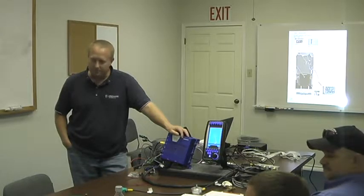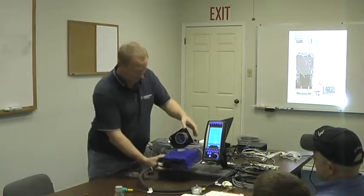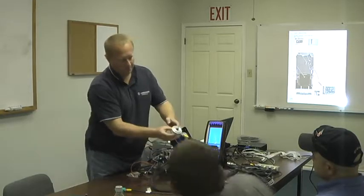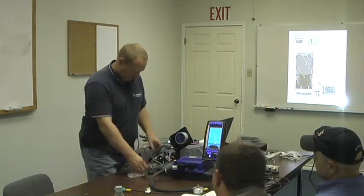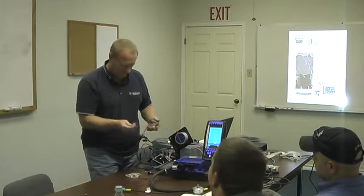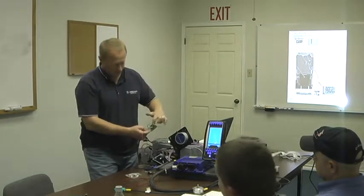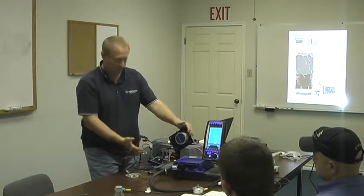Want to show them how it works? Okay, this is the new stuff you'll see. Everything else we have here, sensor wise: CAN encoder for the slew, temperature rotation. The cable reel wise, this is a little ugly, but 10K 10 turn pot, CAN bus conversion board, and the angle sensors that you've seen before. Nothing's changed there.